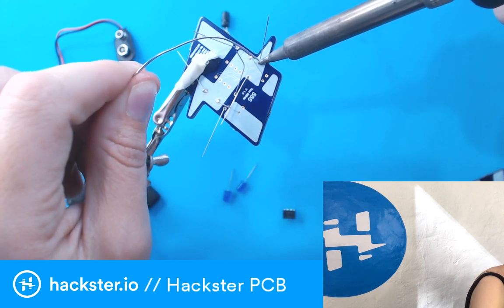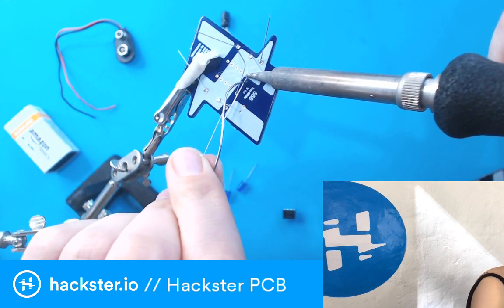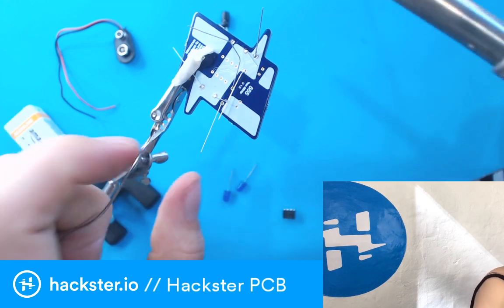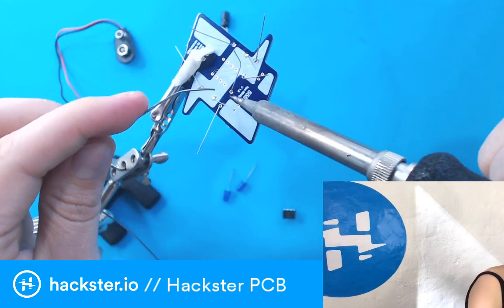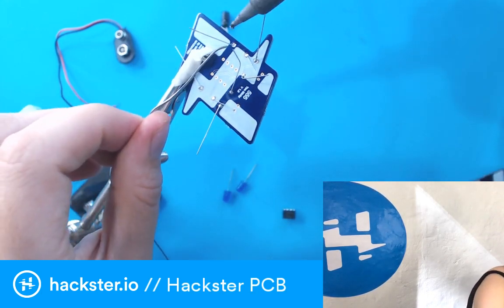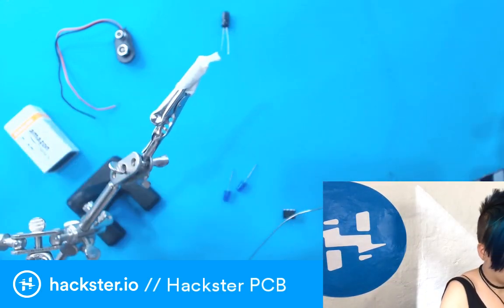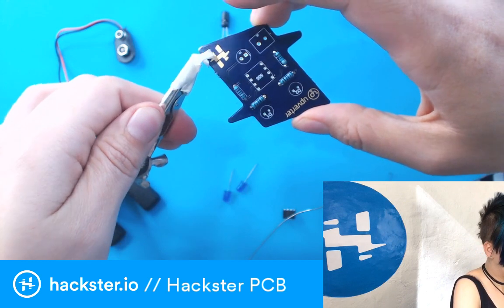When I'm teaching people to solder, often what will happen is that they'll hold the solder wire really close in to the joint. That makes me kind of nervous because your fingers are there, and it doesn't give them a lot of flexibility. I think what they want is control, but really it doesn't give you any extra control to hold the solder so close up to the piece that you're working on — it just makes it more likely that you're going to burn yourself. I'm going to leave these leads on for now, which makes me kind of twitchy, but I do want to make sure that everything's in its proper place before I clip them off.